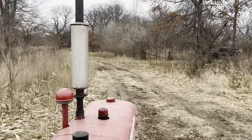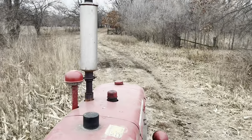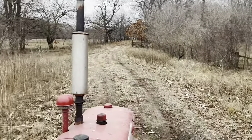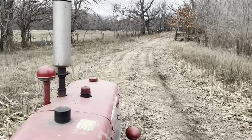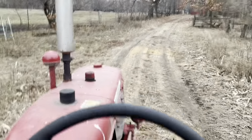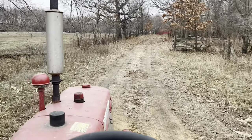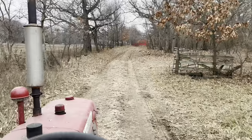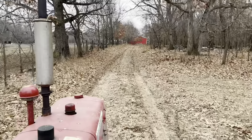That's probably 200-250 bushel of ear corn. Once we get over these little bumps here I'm going to grab another gear - I'm not driving all the way up to the shed in first gear, that's just entirely too slow. But I don't want to be trying to shift in mud either. I don't know if you guys are aware, this thing doesn't have synchros, so it doesn't really go into gear all that easy. You've got to be fast. I'm probably going to get third gear before we get up there, but we've got a little hill here. Going down the hill is a good time to get third gear.